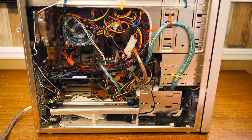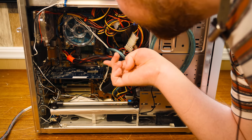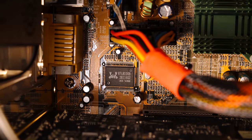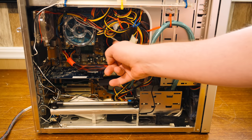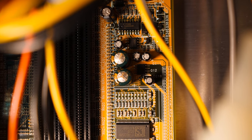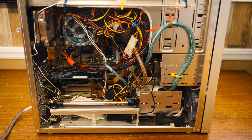I used to put these cold cathodes in my systems in the mid-2000s. Mine were always blue — these are probably blue, makes sense for a fish tank. In terms of graphics, we've got a GeForce FX 5200, 128MB NVIDIA card — pretty generic. The motherboard has no visible branding, just generic Winbond, SIS, and Realtek chips integrated on there. Unfortunately, I'm seeing a lot of leaky caps, which is pretty expected from this era of capacitor plague.